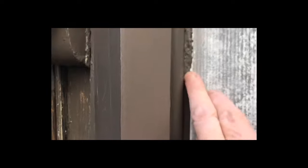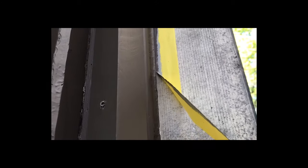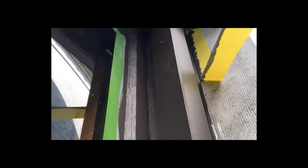There's a little bit of white there but the line is perfect. Some of this came off and I can go back and touch that up. Top Gun 400, which you get from Porter Paint — it goes up under the tape and since it's clear, it fills whatever little imperfections are underneath. When you paint on top of it and pull the tape, you get a really straight line even if the caulk went underneath.